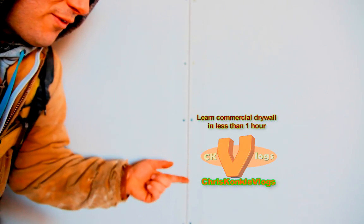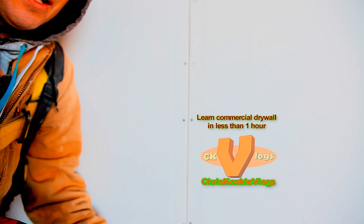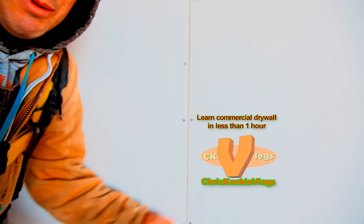Bevels are a little more forgiving than the field, because remember, you don't want to be hitting trowels. And also, if they're not countersunk properly, it's going to show. You're not going to be able to sand those down, right? This is our bevel. When I look up to the top, I can see that my studs are pointing that way. So this is the soft side, and this is the hard side.